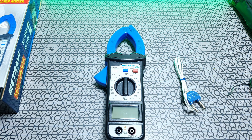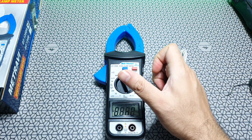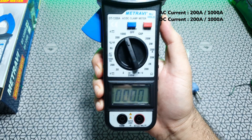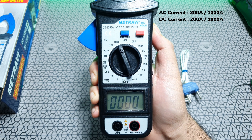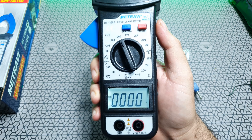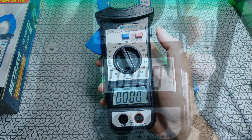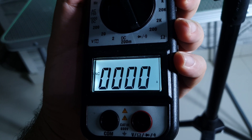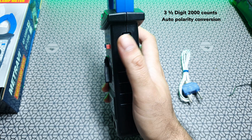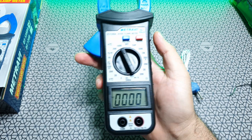Being a professional device, this is built for taking larger readings. The sensitivity can be adjusted for amperes between 1000 amps to about 200 amps, so if you're looking at readings below this range, this is not the right instrument — it's best for bigger numbers, though it does measure lower numbers too. The LCD display is easy to read in regular light, and if you hold the button on the right for some time, the backlight stays on for several seconds to help you take readings in low light.